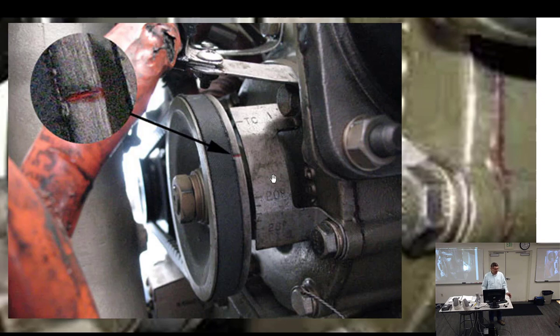So it's not hard. I mean, this time you can put your finger in and kind of go, it's top center. I took a flower pot home, stuck the thing in, put the flower pot on the front, did the whole thing, found top dead center. Okay, there's top dead center. Walk around the back of the engine. Look at that. My red mark was perfectly on top dead center. Then I used the flower pot on the front, put it exactly where I wanted it, walked around the back just to make sure. Yep, exactly where I wanted it. Good. Take the flower pot off. I don't ever need it again because this is perfect. It's fine until I take that starter adapter out. But it works.